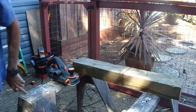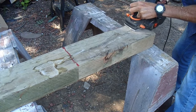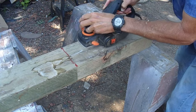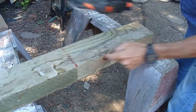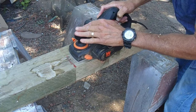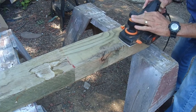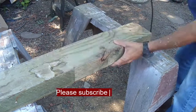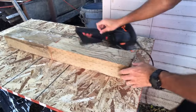The main thing to point out is where to stop planing. You'll see a little 'W' on the side of the planer — right below the W is where the blade is — so stop right there. Ideally you don't want sections of the post above ground that have been planed, because you're taking off some of the pressure-treated coating, making it more likely to rot.